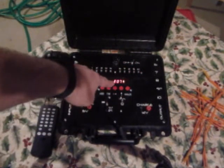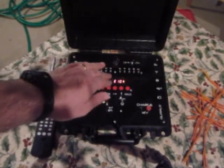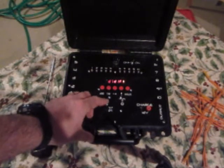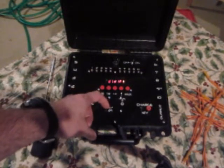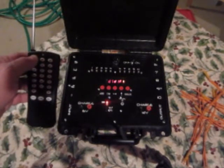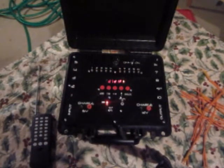Immediately, you're going to start seeing the e-codes, which will indicate which e-matches are bad. Right now we have nothing hooked in, so it's indicating nothing hooked in as bad. When you're ready to fire, the last thing you do is flip on the receiver. The red light comes on — you're now good to go. I programmed this system to button one, and we're going to fire it off. You can see it going through its sequence.